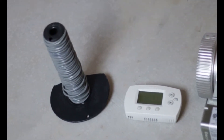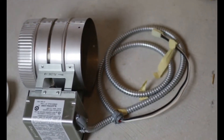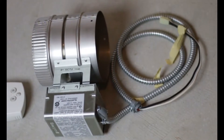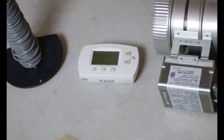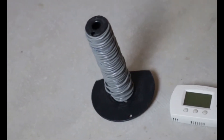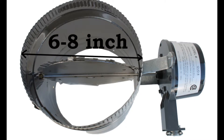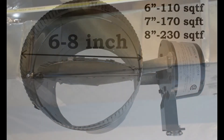What kind of materials are we going to need to do that project? We're going to need a vent damper that works on 24 volts and also needs to be the right size to fit the room. We're also going to need a programmable thermostat and some thermostat wire. The vent dampers come in different models and different sizes — usually between six and eight inches — and depending on your room you have to choose the correct one.